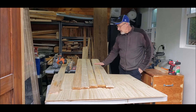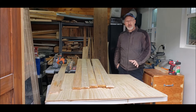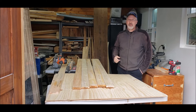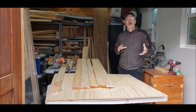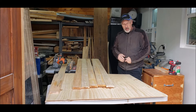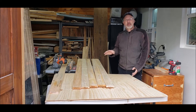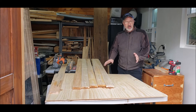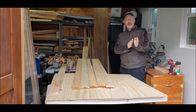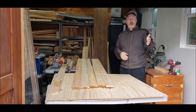What I've got here is one-by-four pine and quarter-inch birch ply. I would like to have done red cedar doors on the front but unfortunately the cost of red cedar is extremely high, and I'm trying to limit this bill to things I already have around or the cheapest products I can find. Two reasons I went with the birch ply: one is to make the doors as light as possible; the other is I have about a one-inch space that I'd like these doors to sit in on the front of the unit so they don't protrude from the front of my trim.